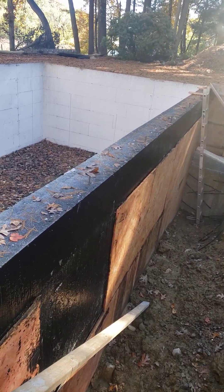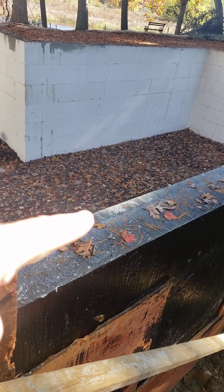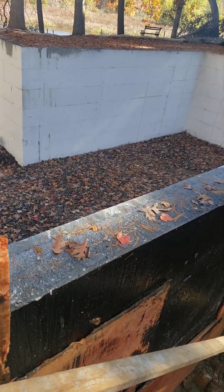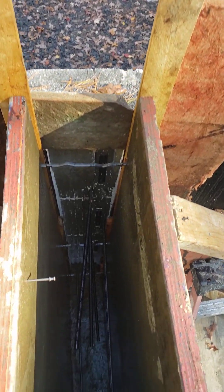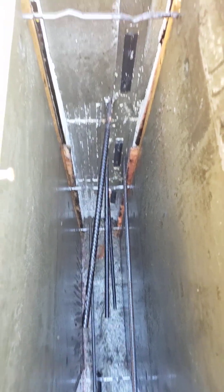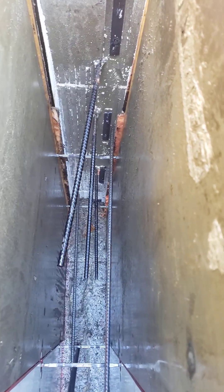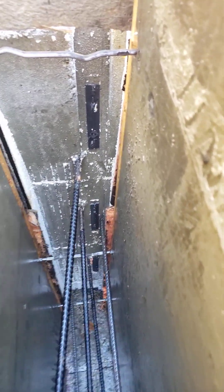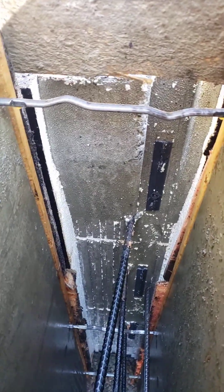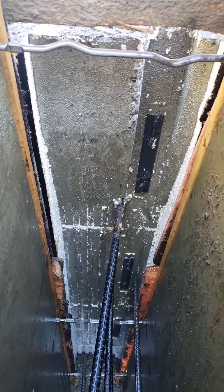As you come down the top of the wall — that's our ICF wall — we have two and three-quarters inches of EPS foam on both sides with a six and a quarter inch core. Coming down the wall, we had the rebar coming out of the wall through the foam, and that was to have that future connection to the formwork here. As I drop the foam in the formwork, you can see we've actually plowed out the two and three-quarter inch EPS foam, so that's the concrete core you're looking at there.